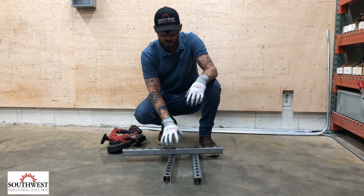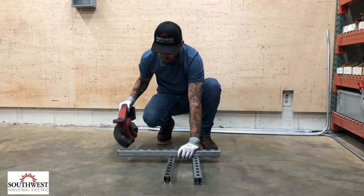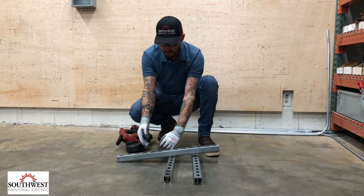In some cases, say you're in the field and you don't have a vise, you can make your own supports. In this case, I put a couple of other pieces of strut down to create a base, get the strut off the ground, and with just a single hand holding the material, the pressure from the bandsaw is not going to move anything.